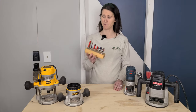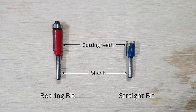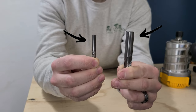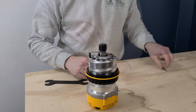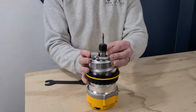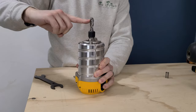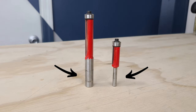You have a router, but what bits do you need? A router bit is made of two to three parts. All bits have cutting teeth and a shank, but some bits will also have a bearing or smooth surface. The shank is the part that goes into the router — always check and pick a shank that fits your specific router. Most routers accept a quarter-inch shank, and some of the most powerful ones will also take a half inch. The larger the shank, the less it can deflect while cutting, so larger bits typically have larger shanks.